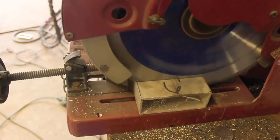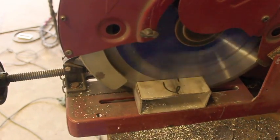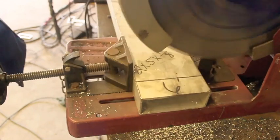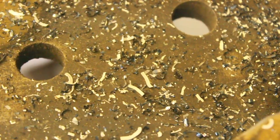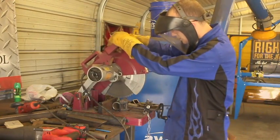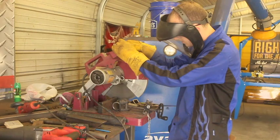The other major drawback is they are very limited size-wise in their capacities. This one will cut a piece of material that's five or six inches across, which is about as good as it gets. For a chop saw, that's actually a very respectable range. However, if you're going to be cutting long sheets of plate or something, this is definitely not the tool for the job. Also worth mentioning is that these chips go everywhere — they're blue so they're one step from glowing, at least the steel ones. They're hot and they land on your skin, so safety glasses are an absolute must — no ifs, ands, or buts about it. I generally like to wear a face shield on top of the safety glasses since they can theoretically get behind your safety glasses.